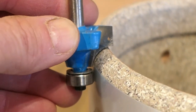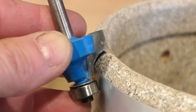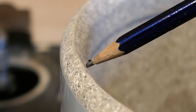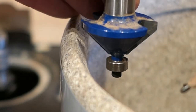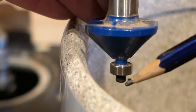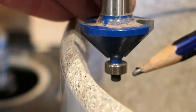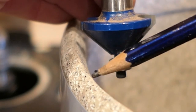I've made the decision that I don't really care too much about the roundover profile matching exactly. It is possible to tilt it a little bit one way or the other using special jigs or a router table setup, and that might make it slightly better, but the difference is not that great. Here's a close-up of the inside edge — you can see it's got this bevel. But if I hold a 45-degree bit right there, you can see it's a much more severe angle. It's obviously more severe than a 45. So if I try to use a 45-degree bit straight up, it's going to cut the top part but not the bottom — it'll be a different profile.